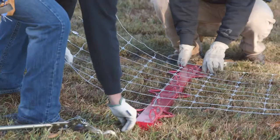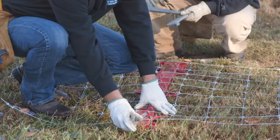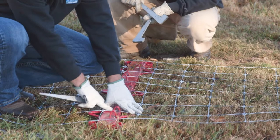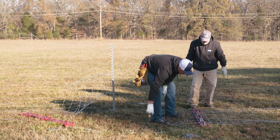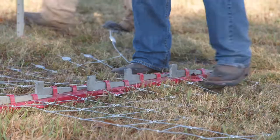The first thing to do is lay the fabric over your stretcher bar. The way these stretcher bars work is you want to be absolutely sure that every line wire is under one of the wedges. The top of the stretcher bar has a slightly bigger loop than the bottom, so your wedges go in through the loops and over the line wires. Now we're ready to seat the wedges — don't be afraid to hit them. The steel is a little bit softer so you're not going to damage the wire too much. You'll hear a distinct tone difference when the wedges seat.